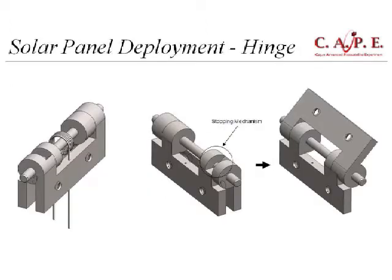We designed a simple spring hinge to deploy the solar panels, designed according to an off-the-shelf torsion spring we could buy. We came up with a simple mechanical stopping mechanism to lock the spring at an angle of 135 degrees. We're not certain that 135 degrees is optimum, but we'll conduct tests, and it'll be easy to manipulate that angle later by changing the angle in the slot between the two edges. Once we have the appropriate angle, we deploy the panels to that specific angle. It's an extremely simple design — we lock it down using a fishing line mechanism, burn it using a resistive element, and deploy.